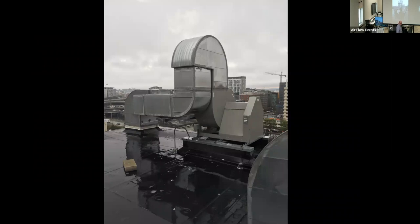This one is another one. I use this one almost as a poster child. If you'll notice, the fan discharges that way, forces it back, it breaks the backbone of the air, forces it down, back, over, back, and down. This could have been completely handled differently. Thankfully, this is a different fan manufacturer, but believe me, we all at AMCA and ASHRAE meetings, we all commiserate at times and we show pictures and trade them back and forth and go from there. This one several people lost hair over this install until some photos and field visits took place.